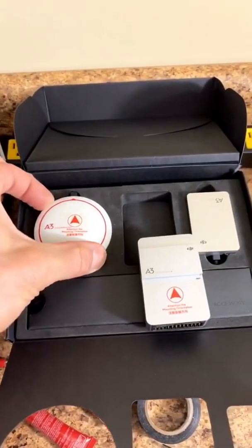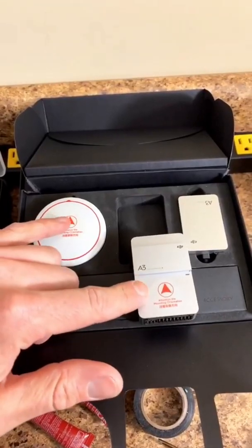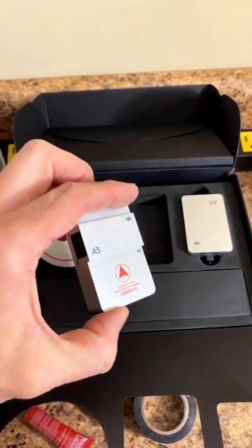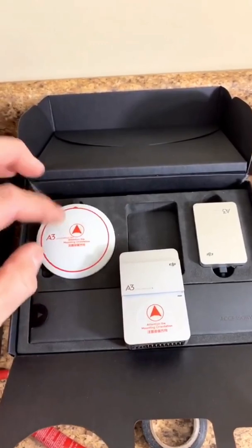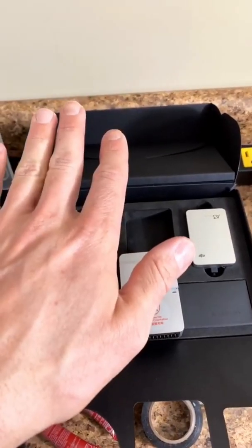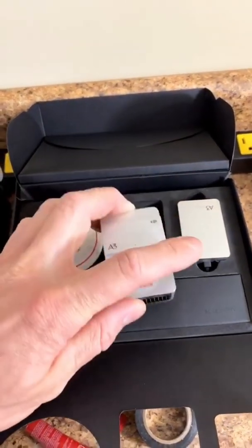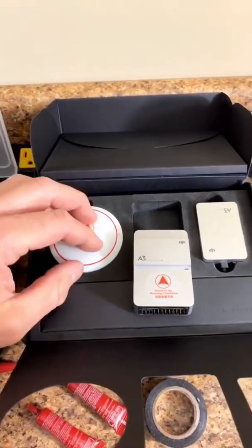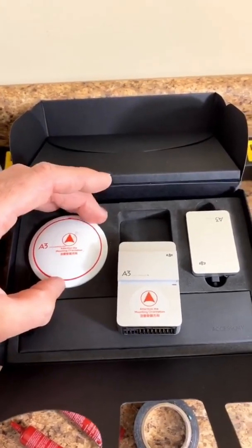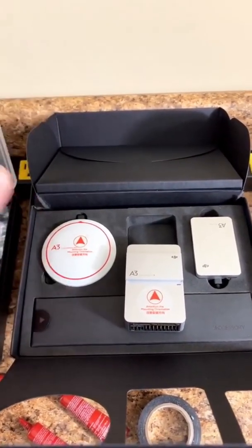This right here is the GPS puck. This will pick up satellites and tell the drone where it is. Between these two components, this allows the drone to maintain stability, to fly, and to maintain an accurate heading and an accurate position. Without the GPS, we could only maintain level flight and just maintain authority of the drone. But when we take the internal IMU and the brain and couple that with GPS — when it knows its position in space — that allows us to do accurate hands-off hovering and allows the internal computer to fly the drone completely autonomously.